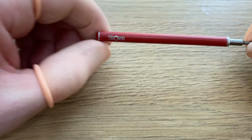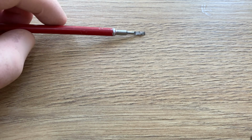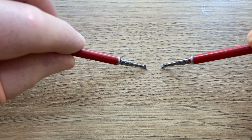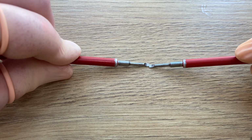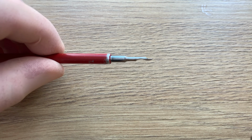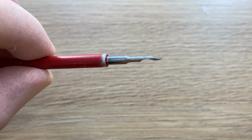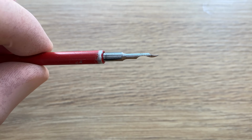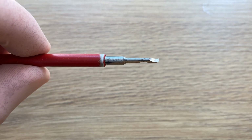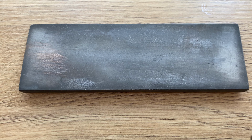Next up we have my old Horotech pair of hand lifting levers. Now these still serve a great purpose in my workshop. I use them generally for small sub-dials of chronograph hands, just because I can get under there and I can make the tips really, really thin. A lot of the times when it comes to watchmaking tools, they aren't ready out of the bag. Same is true for screwdrivers. They need to be sharpened. Same thing as with these hand lifting levers. We sometimes need to stone them down so that we can really get a nice thin tip underneath the hand.